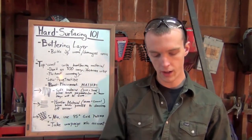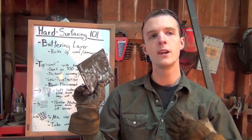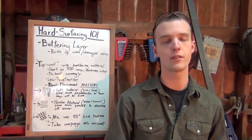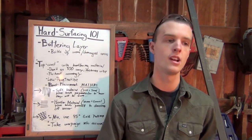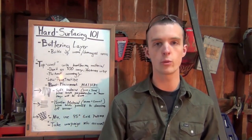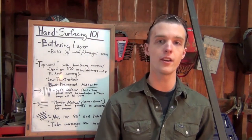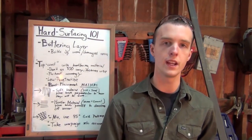My little simulated piece appears to be just regular low-carbon mild steel, so I'm not going to really mess around with preheat. However, the higher the carbon content of your steel — if you're working with any kind of manganese steel or cast iron — you're really going to need to preheat that. The higher the carbon content, the harder it's going to be to weld without cracking, thus the more preheat you're going to need.